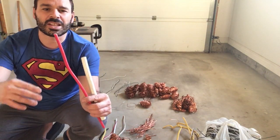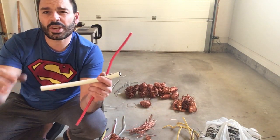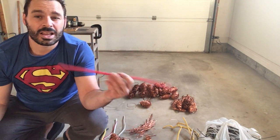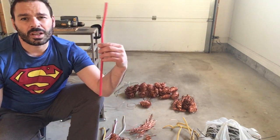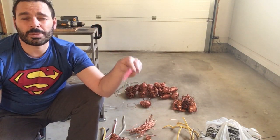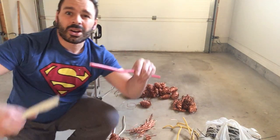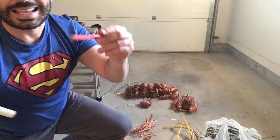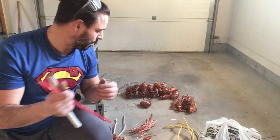Aluminum wire is about 90 cents Canadian a pound clean, probably 20 cents with this coating on it. A wire stripper can easily take that coating off, and you can, like I said, gain 70 cents a pound on this. Aluminum is also conductive. It's cheaper to make, it's cheaper to use, and actually a lot of our motors now that we're starting to find while scrapping are becoming aluminum. So having the wire stripper, it is also beneficial to be able to strip this and maximize your profit from this as well.